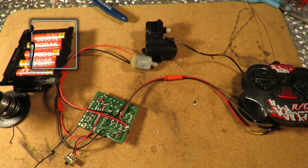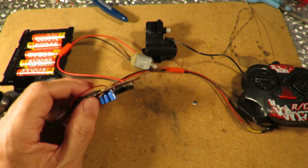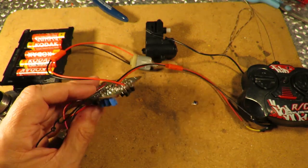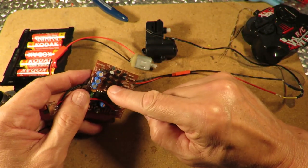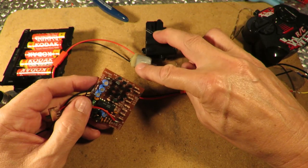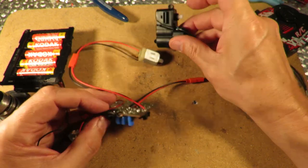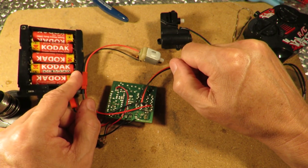I thought I'd do a little bit of work on this toy grade receiver that I burnt out on that toy grade monster truck the other day. I pinched it out of a little mini Cooper toy. It's 27 megahertz, so I've got a 27 megahertz transmitter. These black transistors here are the H-bridge which controls the two motors. That top set of three will control this motor, that set of three will control that motor. They're just random motors that I put connectors on so we can demonstrate. I'm running it on five double-A batteries.